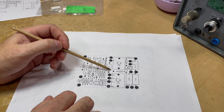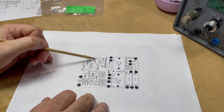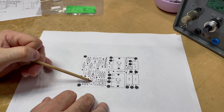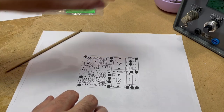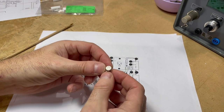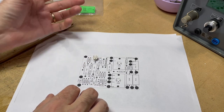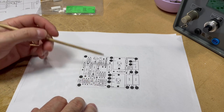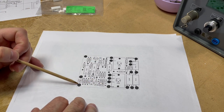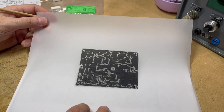The same sizing check applies to capacitors. The input-stage transistors are TO-92 black epoxy body devices. The pre-driver is a TO-5 metal-can transistor, and we verify it fits with adequate clearance. Ceramic capacitors have been sized correctly, and there's one radial electrolytic for the input capacitor.